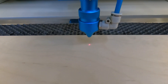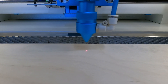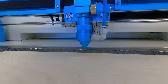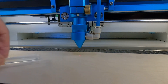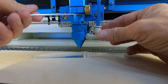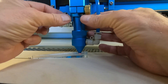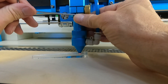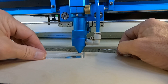And you notice now that we are way off on our autofocus, and that's because we lifted up this lens to use it for our pass-through. So what we're going to do now is just the opposite of what we did before. We're going to come in here, put our focus material in here, loosen this up, drop this down, bring this ring back up so it's in its normal position, tighten the focus ring back up, tighten this back up. And we've just reset our autofocus. That's how easy it is.